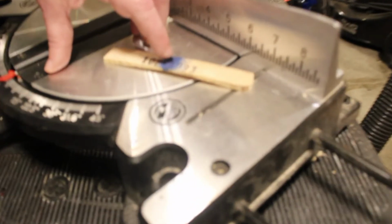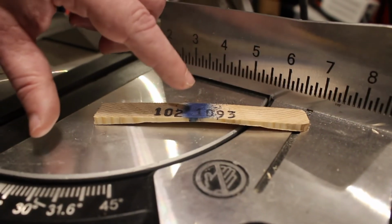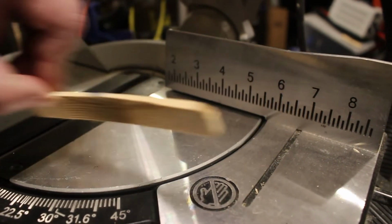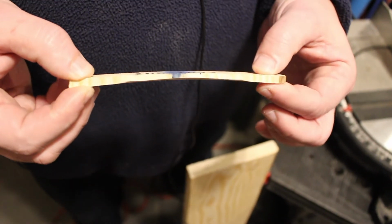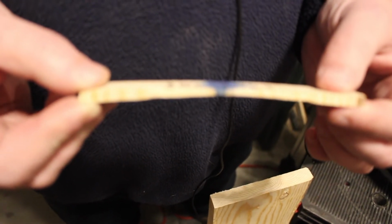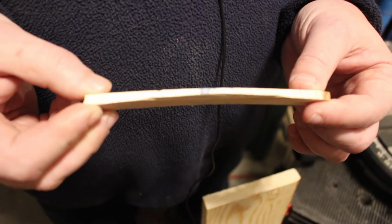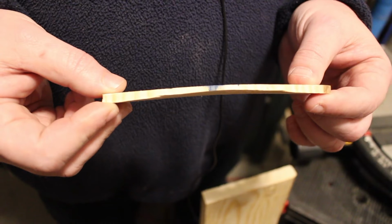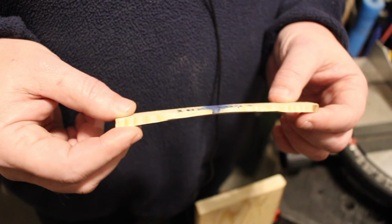Back to woodworking, if you come here, you can show how much of a bowl that has. Is it visible? And look how much bowl that board had that we took out. And of course, you can also see it because this is not equal thickness. Is that visible? Well, if your camera would focus, sure. Stop blaming my camera. Then hold it still. There you go. So all this thickness would have made it impossible for us to have a nice flat connection to the next board. And we're going to have to do that with all boards.